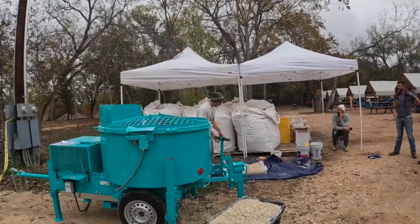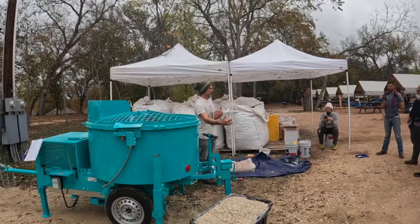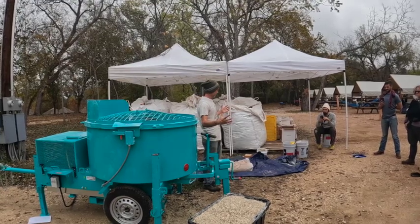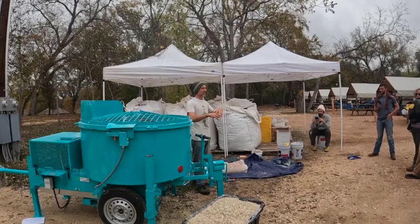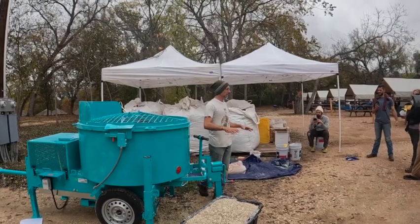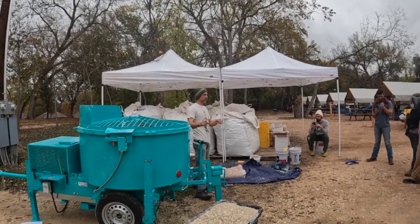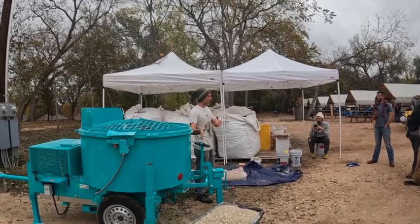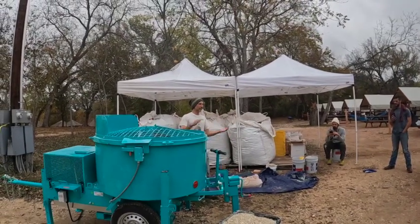And then the binder is around 6 or 7 pounds. There are some other products on the market where they make the lime and the binder already mixed together. It's a hydraulic lime basically. That comes in a 55 pound bag, so it still works with the same ratios, the 44 pounds of hurd. Approximately 11 gallons of water in that mix.